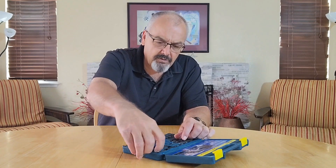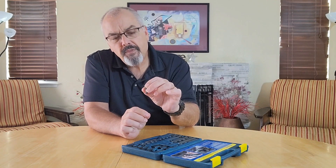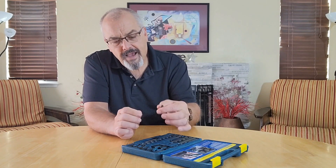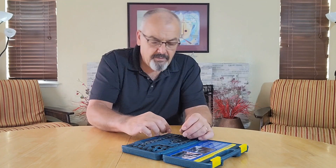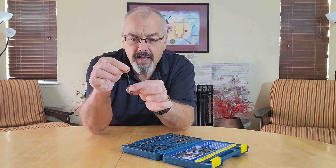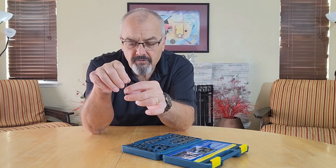Sometimes it's very hard when you're trying to drill a hole over the top of a screw or a nut that's been rounded off. You can just slip this guide over the top of it, and then run the drill bit down through the guide to drill your hole. So that keeps everything nice and centered and straight.